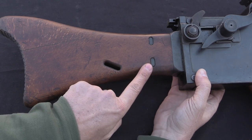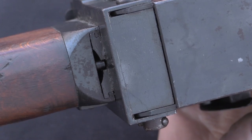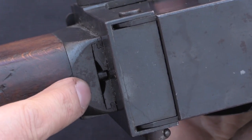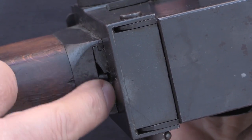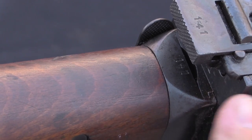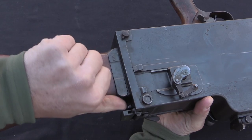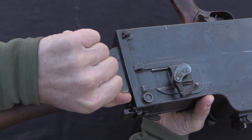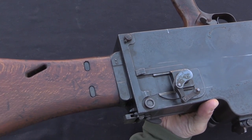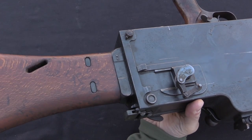There's now a much deeper metal plug in here, a couple of cross pins to hold it in place. The stock is now actually dovetailed onto the rear receiver plate — you can see the over-travel pin right there and the grooves that it slides in, as well as the grooves up here on top. On the left side you have a spring tab; you lift that up and then you can slide the buttstock off. This one is very tight on the gun so I don't want to try to hammer it off, but that is how you would actually remove the buttstock.